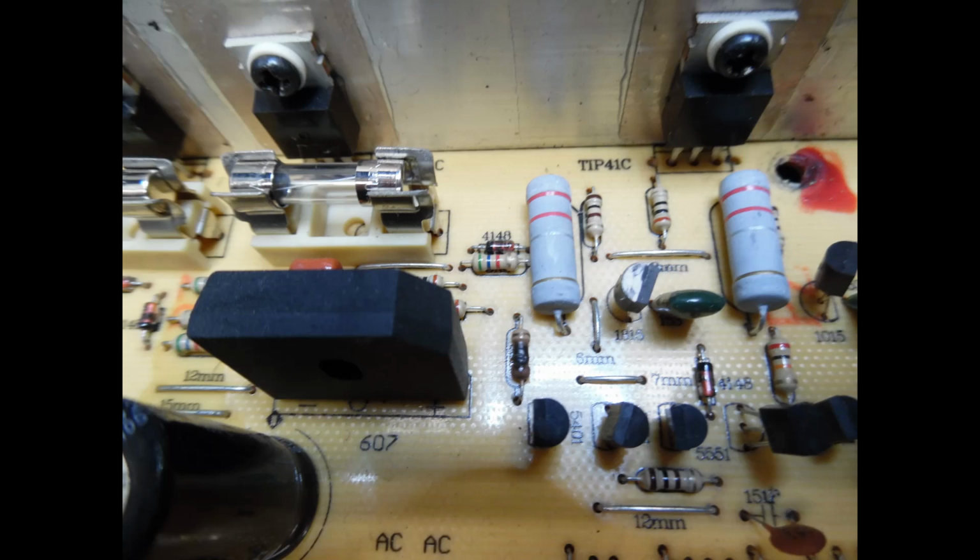So it does make fault finding super easy for maybe people who are doing this for the first time, and it removes the guesswork of, well, what's the value of that burnt out resistor? You could refer to the working channel, but if it was in a part of the circuit where you didn't have a duplication, it may be difficult to determine. So that's what you have.